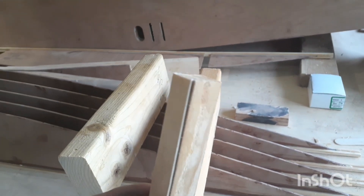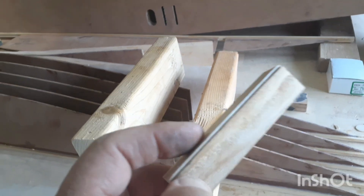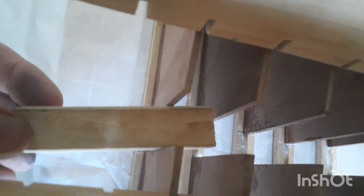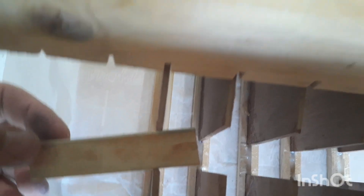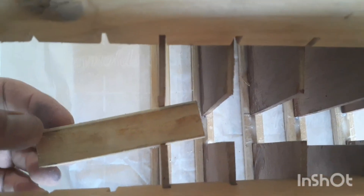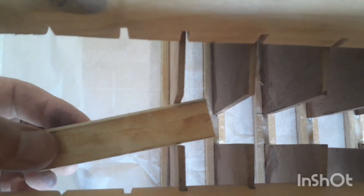This here simulates a spar, and I added a 1/16th-inch tongue depressor because when the spar goes on it's going to have a nine-degree lean to it — if you can see that, nine degrees like that. Because it's a biplane, it has a nine-degree spar-to-rib angle.